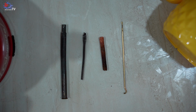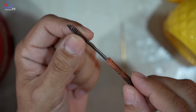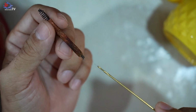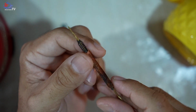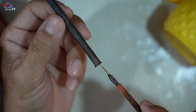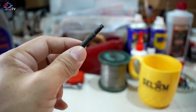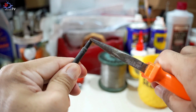Alright, putting all together before we fire up, picking up the spring and also the brass mesh gently, and insert the newly DIY brass generator needle. Insert it gently. Alright. Of course, the nut, picking up yourself a long nose plier or plier, just gently tighten it.